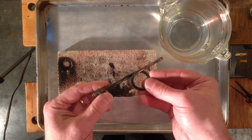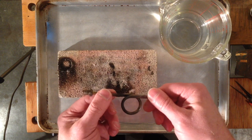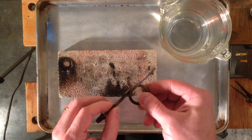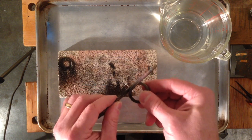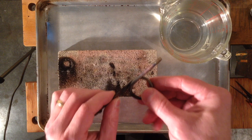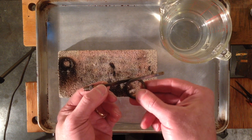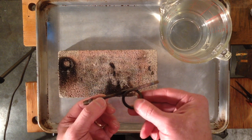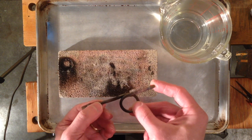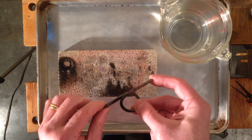Some people have had good luck with an air hose, just blasting air from the top — it'll shoot out the bottom once you've heated and quenched it a few times. I also want to clean this out, boil it in some citric acid, and use a brush to brush it out. And I can't do that when it's in this bent state — you can't get a brush through the loop. When you remove the packing, because it's asbestos, keep it wet so you don't get fibers in the air, and take appropriate precautions.